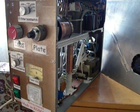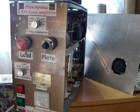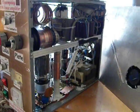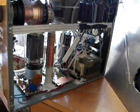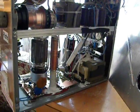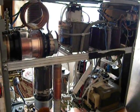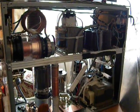Welcome back. I am back with a new video about the Perestroika linear amplifier, which has just been rebuilt. I wasn't happy with that amplifier because of the very high drive it required to obtain 1 kW. It seems that this tube in grounded grid connection is not the best option — it required 100 watts or even more than 100 watts to achieve that 1 kW.